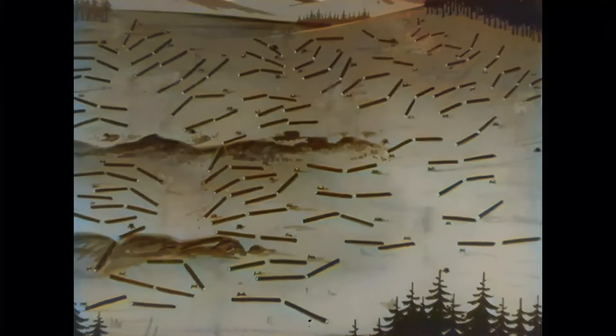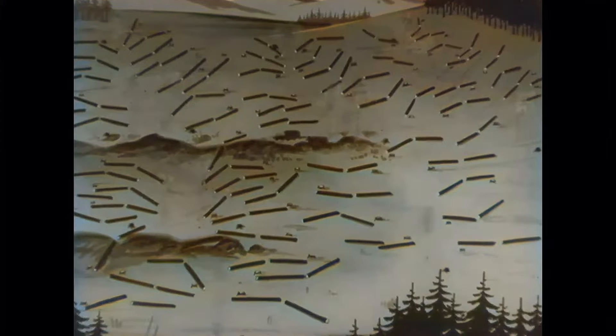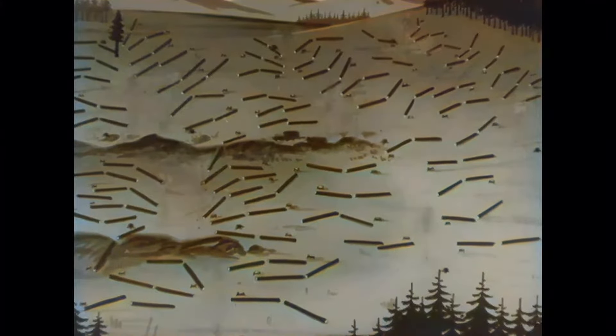The winch is best suited in hilly terrain, and primarily on clear-cuts, seed tree stands, and shelter tree stands, when the lunding distance varies from 100 to 300 meters. In advance, the field is divided into 30–40 meter wide strips, where the trees are felled toward the place where the carrier cable will be stretched. Already during the marking, trees have been selected for end trees, master trees, and hanging supports.